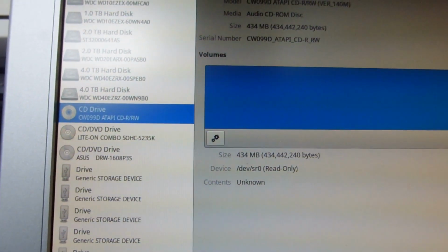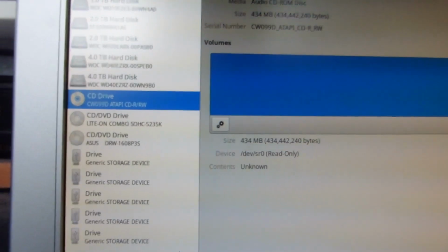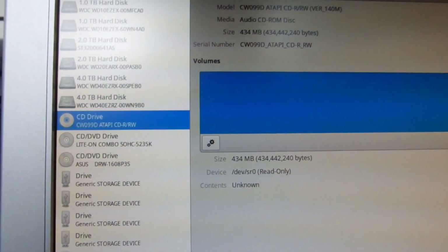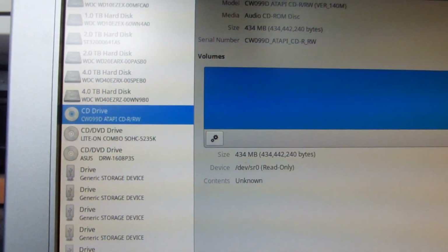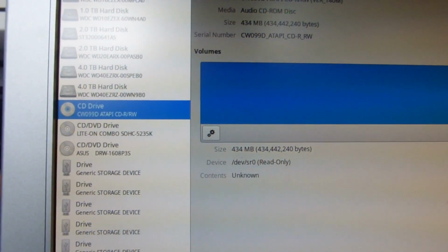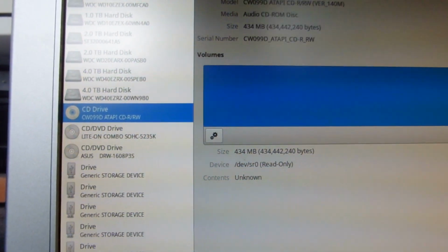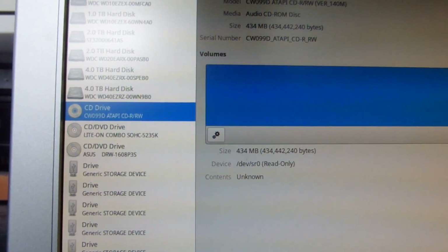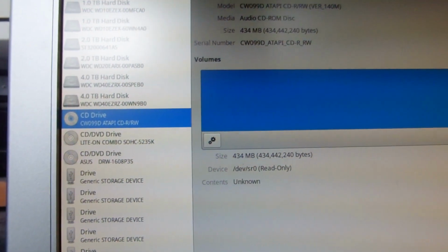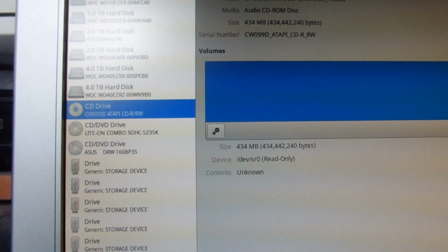So it looks like that's all done. So there you go. It just goes to show expansion cards are not immune from bad capacitors, which I suppose should be obvious. But if you're having some weird issue with an IDE card or a sound card or any expansion card really, it's something to look at. And like this one, it kind of made sense because the card is several years old, it's had lots of use, and it's not exactly the most reliable brand. Like I said, I just bought the cheapest one I could on eBay, and I'm kind of surprised it actually lasted this long.